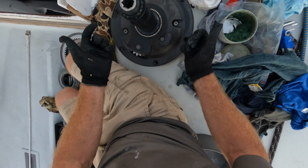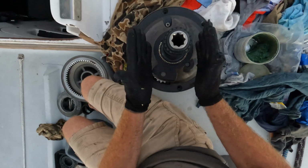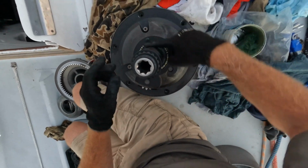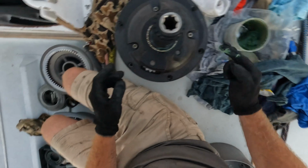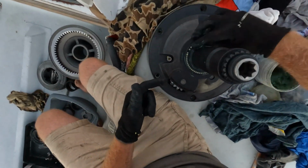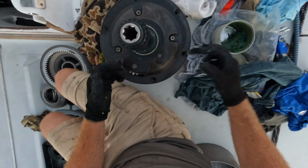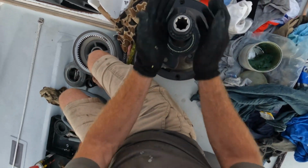The damage that we had on it, where it's sitting with the load from the lines sitting on the winch, you know, where was that? Maybe I should have found out properly when I was putting it back together again, but if I did know that, I would definitely move it so it was in a slightly different position. I don't want the inside of here to become ovaled over time, so I'm putting them all back now with this at about the 6 or 7 o'clock position. Next time I'll put them back at the 3 o'clock position. Just keep trying to move things around.